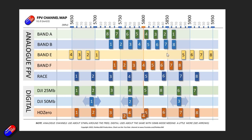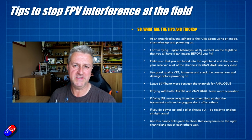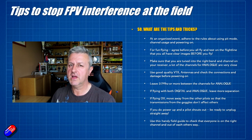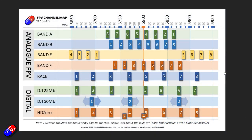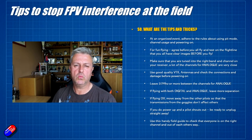The big tips: hopefully you can print this chart out and put it in the bag when you go to the field. I would recommend using high quality gear, making sure there is enough separation - you need at least 37 megahertz between each of the analog pieces. And if somebody is using digital, I would give them a very wide berth in terms of band and channel versus the one that you use. Keep them on opposite sides of the chart if you possibly can.